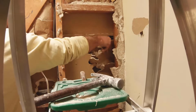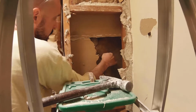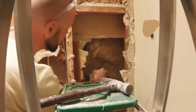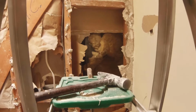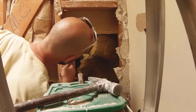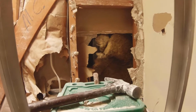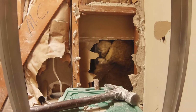We suspect there may be a duct back here feeding the kitchen underground. Yep. There it is. So that's gonna maybe have to change depending on what we can get away with for the client. This wall's supposed to be pushed back so we can get a larger vanity in here, but we might have to retain the vanity size we have, create a little pop out here for the duct chase to stay exactly where it's at. That's not too bad. Yeah. And good news is that wouldn't affect what we have to do for the shower. The shower can still be enlarged, the room can be enlarged, the vanity itself will just be a little shorter. We'll see what they say when we open this up fully and start getting the new framing in.